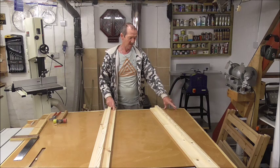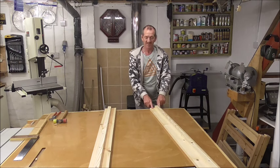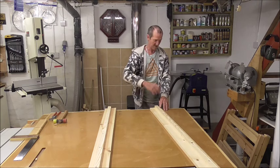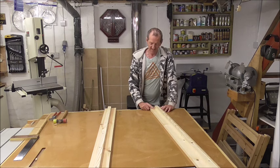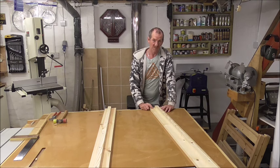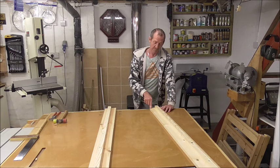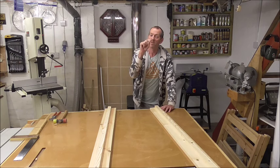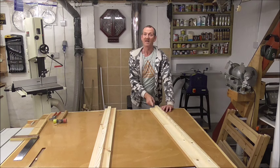through the body of the bedstead into the stretchers, and the hole for the bolt itself, which will pass right through. It'll be countersunk into the bedstead. In here then, at two-thirds of the bolt's distance, we want to drill a hole through the side, on the inside of it, to put in the captive nut, which is usually a barrel with a thread in it. That goes in there, and then the bolt can go in and tighten to it.